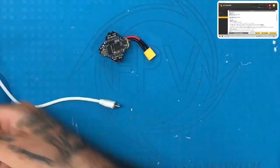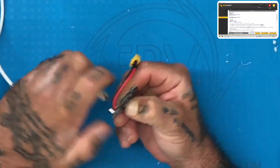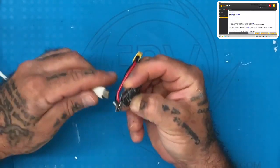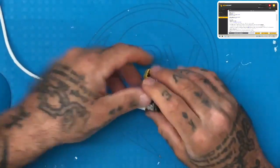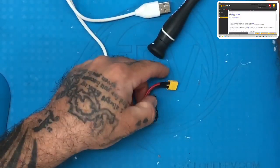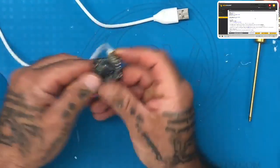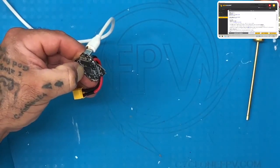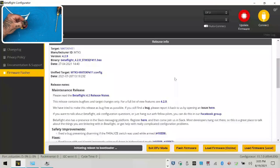So here's what we're going to do next — we're going to press that. I'm going to press it with my finger, hopefully be able to plug this in at the same time. I've got the button held and now I'm going to plug in my USB port. It didn't work because my finger slid off. Let's try this again — hoping that I'll get DFU mode. I'm not able to hold this button down. I'm going to hold it down and plug in my USB cable. I'll use one of these little tools here to press this down. I know I've got it pressed down right now and now I'm going to plug it back in. You see how it says DFU now on my screen? Boom, that's what we need. Now we can let go of the button, and now we're going to go ahead and click Flash Firmware and it's going to update.